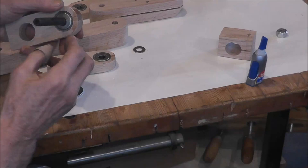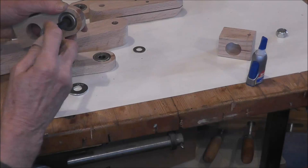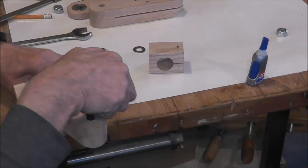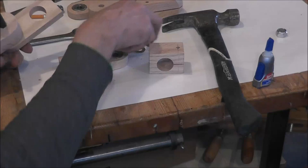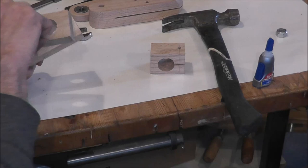If possible, put a small bearing on the inside that doesn't come out to the outside. Now you might be able to buy these smaller ones — you can see the difference in size — at a hardware type store, or I'll give you a supplier where you can get these types. They're easily available. So we put that in the inside there, then pop that through. Then the other side gets a large washer and then the nut.